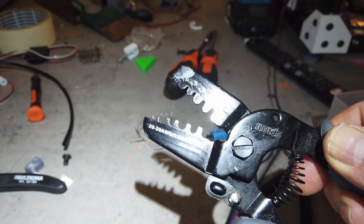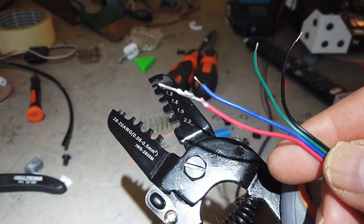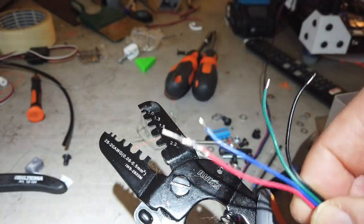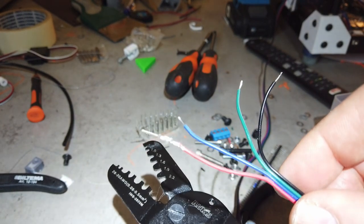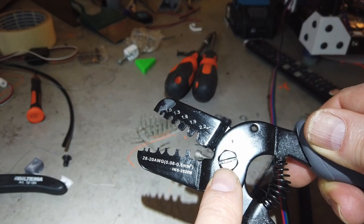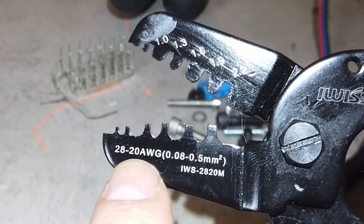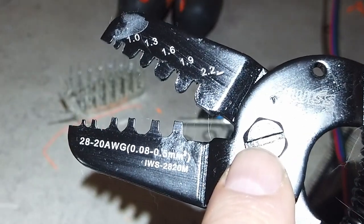I'll have a look and see how it works — link down below to this crimping tool. This is for doing proper cable management, which is very important when working with electronics. A good crimping tool is very important when working with small wires like AWG24, which is present in most 3D printers. There are also two versions of this one, covering AWG28 to AWG20.